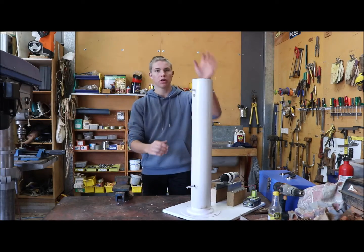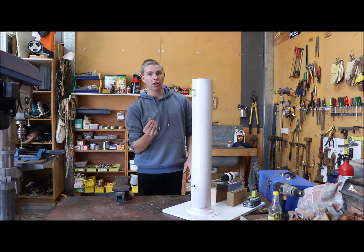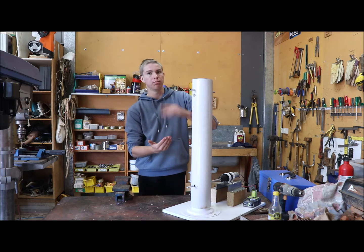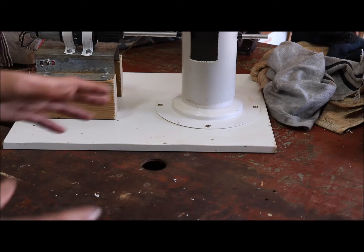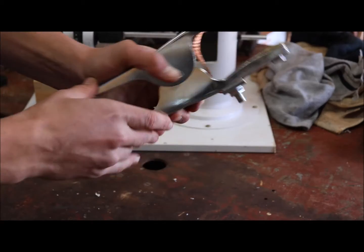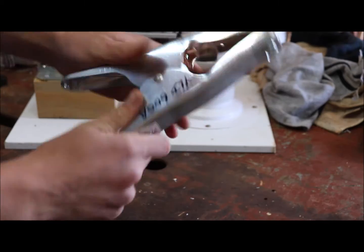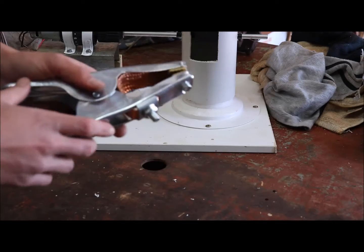We've got the motor and the belt all in position — next part is actually the brushes. They're just lots of fine bits of wire that come to the bottom and the top of the rollers, not quite touching the belt but very close. That makes the electricity jump from the brushes onto the belt, pushes up, and then jumps from the belt onto the top brushes and into the big ball. For the brushes I'm going to use a welding clamp — there's copper braid on the inside of it that's really good for what we want. I've also got a brush from an old motor to use as well.